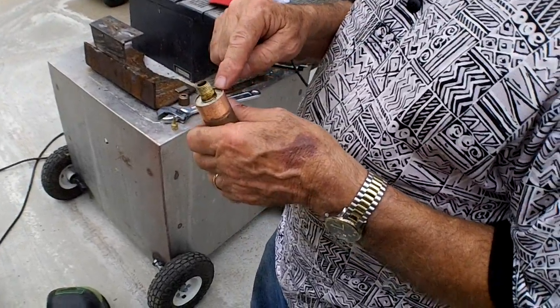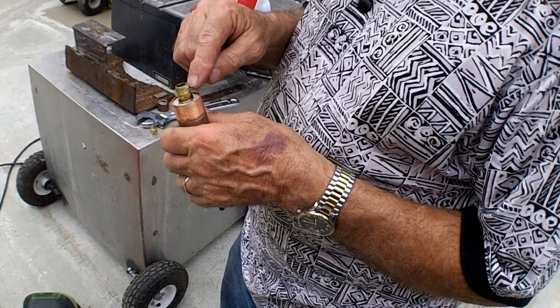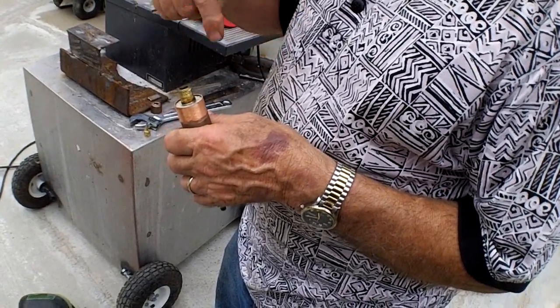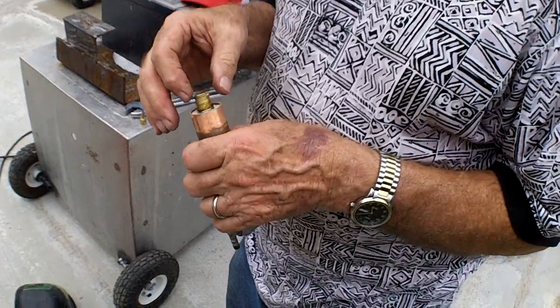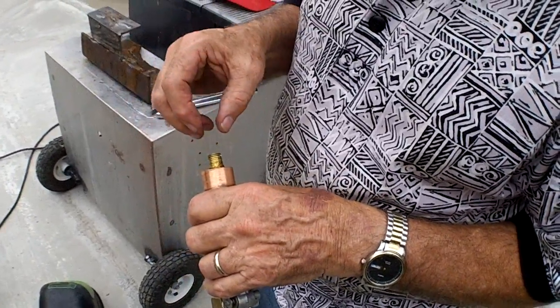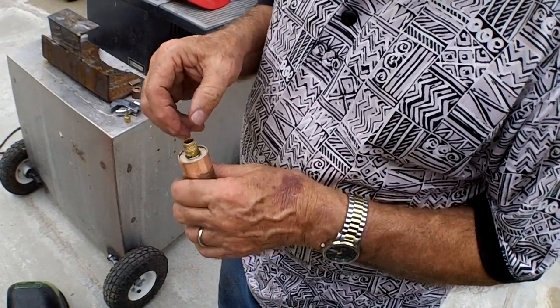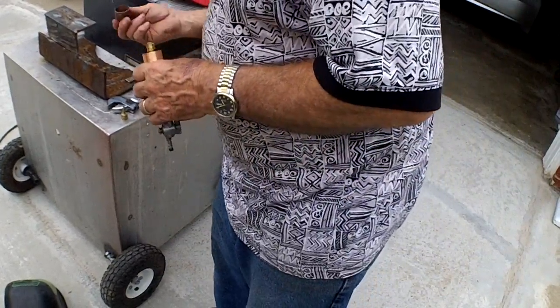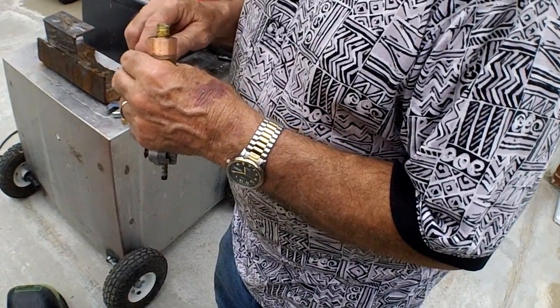And the welding wire — what I did is I got a diameter of pipe smaller than this, and wound it real tight, like a spring. It acts like a spring, and then when I put it on I just kind of pull the spring back so there's just a very little crack in the wire itself. That's .035 solid core — yeah, that's what it is.